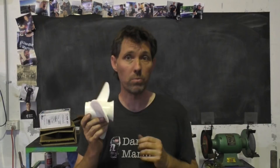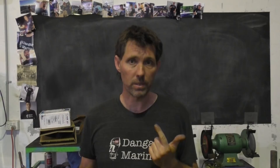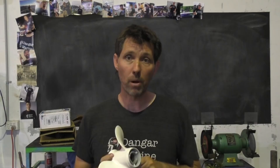Another characteristic of each prop is what it's made out of. You get some plastic composite props, aluminium props, and stainless steel props - those are the most common ones in outboards. On larger boats you get brass props, but generally for outboards it's plastic, aluminium, or stainless. A lot of very high performance props tend to come in stainless because stainless is quite strong and won't deform over time as much as aluminium will. But to be honest, it's a little bit of diminishing returns. I think aluminium has the best bang for buck. They will get damaged a bit more if you hit something, but a dinged-up aluminium prop isn't going to be that expensive to replace, whereas if you start hitting your nice stainless prop into some rocks, there's probably still going to be tears when you look at the cost of replacing it.